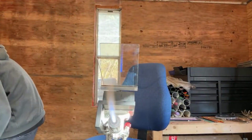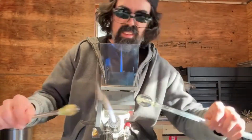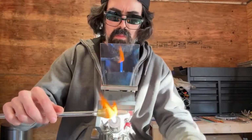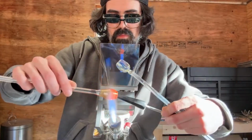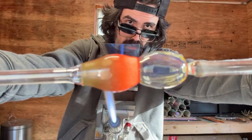Going back and forth between the side of the L-marver, flattening that ring, and then using the reamer to open it up again just helps keep a nice, even, consistent ring. And trying to make sure it's right on center too. Just matching up those two sized holes to the same diameter so that we don't have to smush that lip wrap that we made.